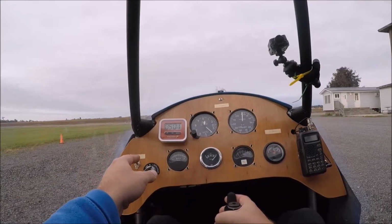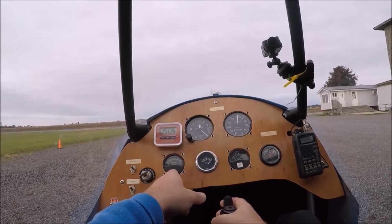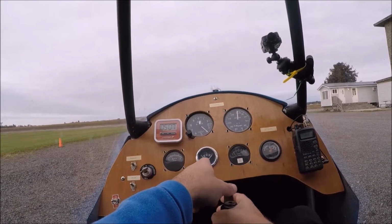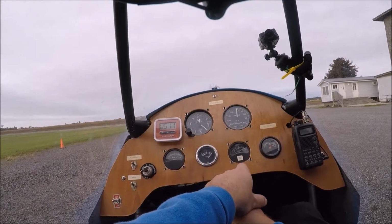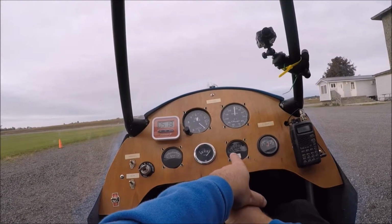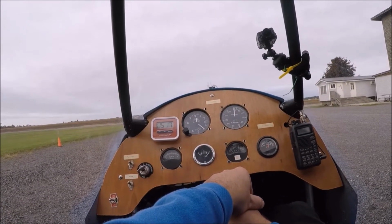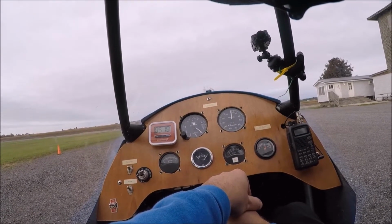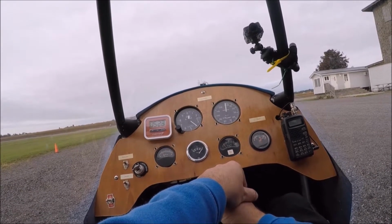Switches, mag, timer's running. RPM is reading. Our fuel is full, which we've seen physically as well. Cylinder head temperature is below 2, that's in hundreds, right? Yeah. Okay, so below 200, which is expected for idle. It's coming up, yeah. And we have plenty of volts reading. And 1232 is the appropriate frequency.